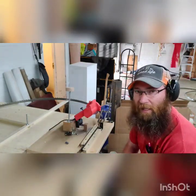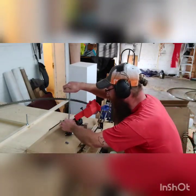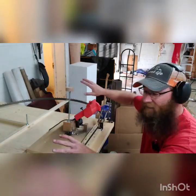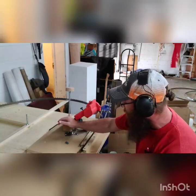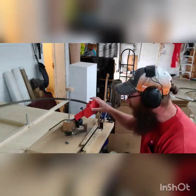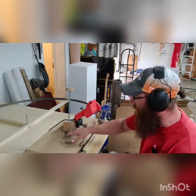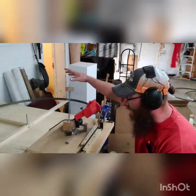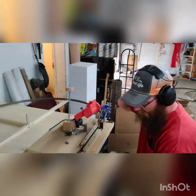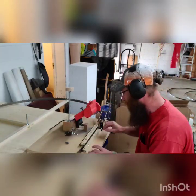So I'd like to sharpen them at the proper angle for that blade. So it's easily adjustable. I can just loosen this nut, twist this knob, get the angle that I want, tighten the nut down, and it stays put. The weight of this oak block, which is one of the reasons why I use such a beefy oak block, in combination with the motor, keeps everything pressed down against that steel block. If I lift it up like that, it drops right back down every single time. And it's not gonna bounce or move around or do anything like that. So that's that part of the setup.